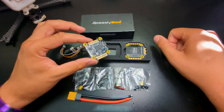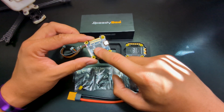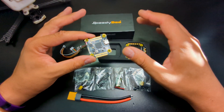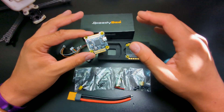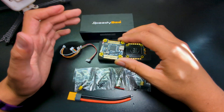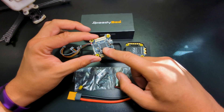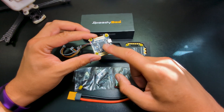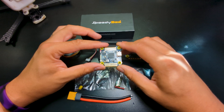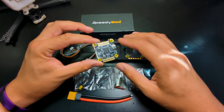The low dropout voltage regulator providing clean DC input to the gyro on this flight controller versus version 3 is a Maxlinear brand, which they say improves surge protection into the gyro by about 320% — a pretty big improvement for overall reliability. Both the 5 volt and 9 volt BECs on this flight controller are capable of outputting 3 amps, which is better than the 2 amps the previous version could do. That's especially good if you're using a DJI O3 air unit, as those are quite power hungry.